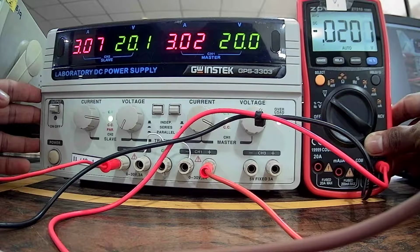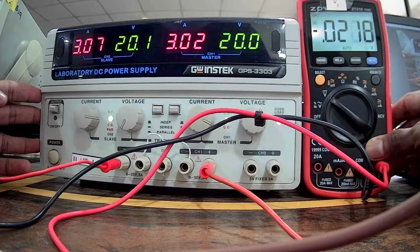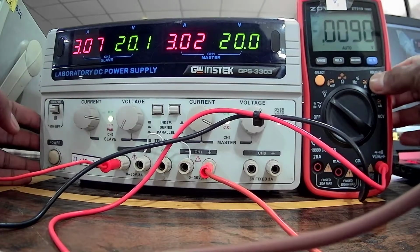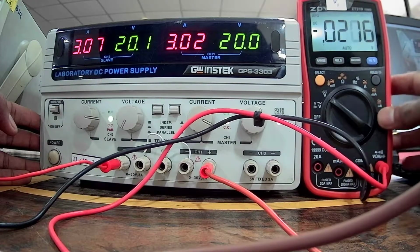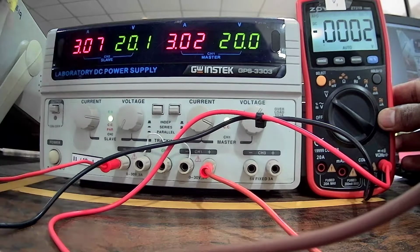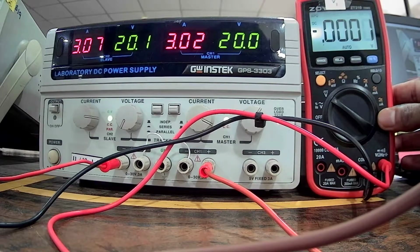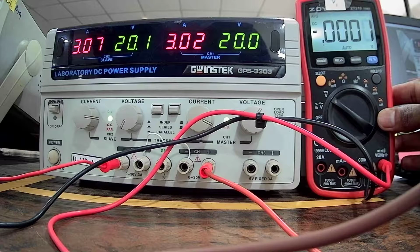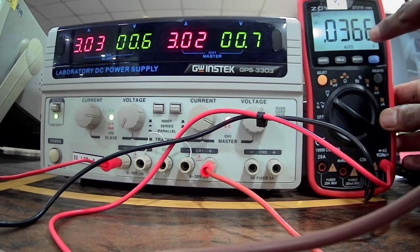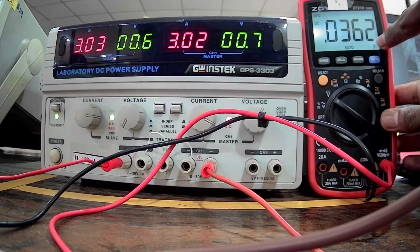in this contact point or the joint, there is a small resistance. That means you can assume it as short circuited. Right? In a short circuit, if we measure the voltage across that point, the voltage should be 0, but in this case we have a small resistance in that contact point or the joint. You can see a small voltage. That means like this voltage. Right?